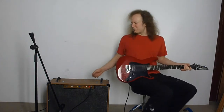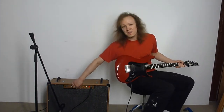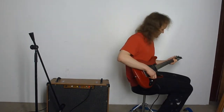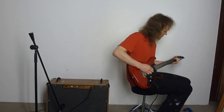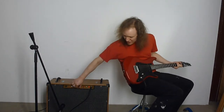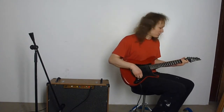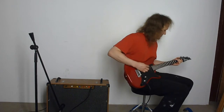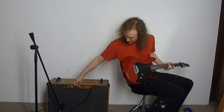We got that in there — I'm pretty sure I've played that riff before, I'm repeating myself, I need to come up with some new things to play. This can also be very bass heavy. I'm going to pull the bass up all the way just for a moment to demonstrate that. If you really want to pin the bass on there, it can get up very high. That's because it has large coupling caps throughout the whole thing and a really beefy output transformer, so it's got a lot to give in that regard. But of course you can pull it back a bit.